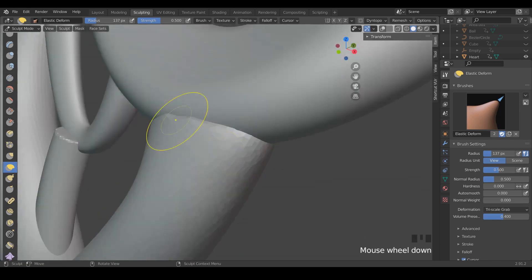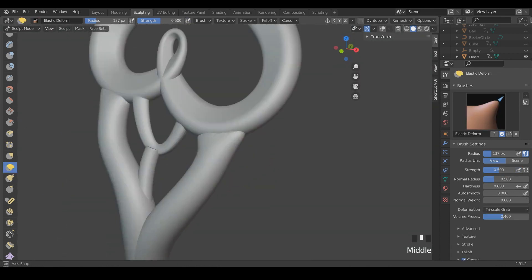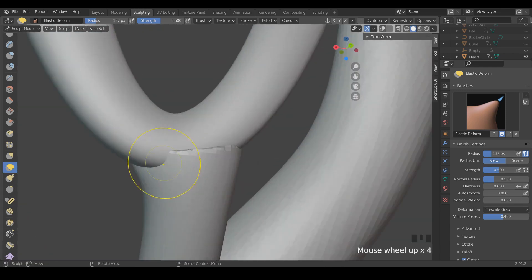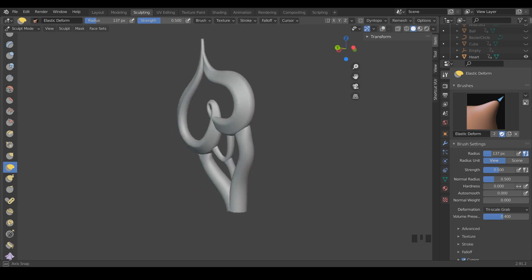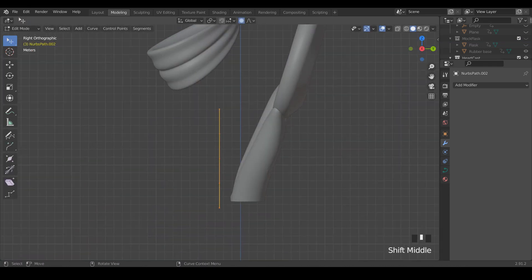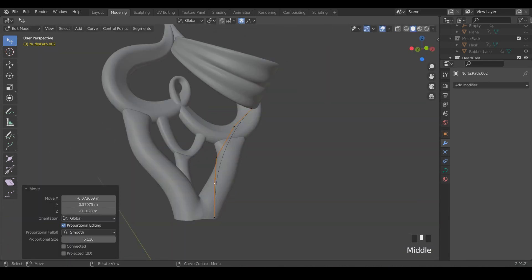I'm going back and forth with the deform brush in Blender to push the ends of the sprue to where they're mostly connected to the part of the curve, and extending the sides out so that this area doesn't become too narrow for when the metal flows into the charm. I also modeled up a quick example of the rubber sprue base, just to get an idea of how I'm going to orient the pieces in the flask when I go to attach them to the sprue base.